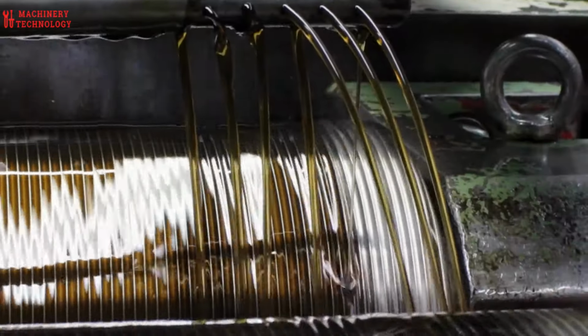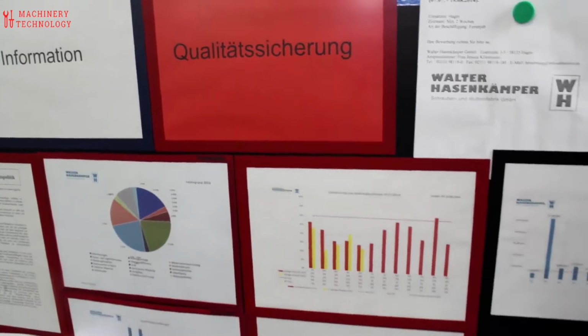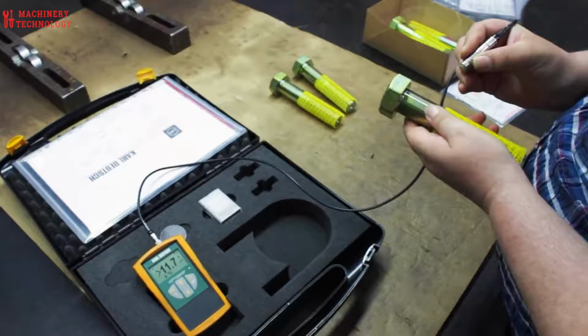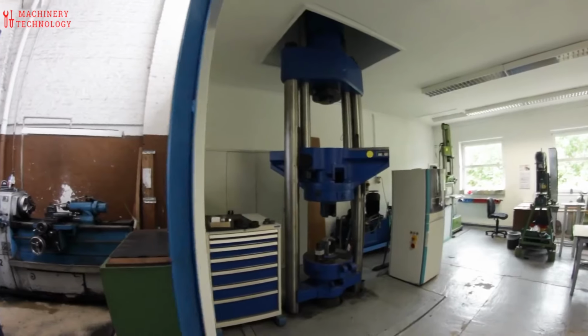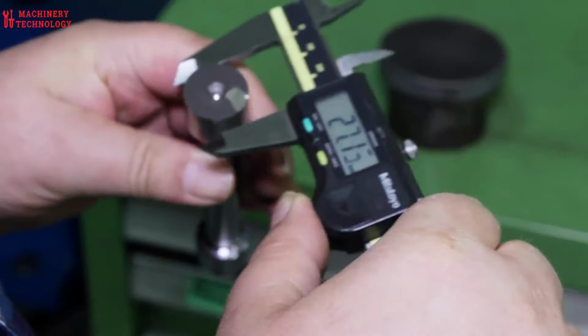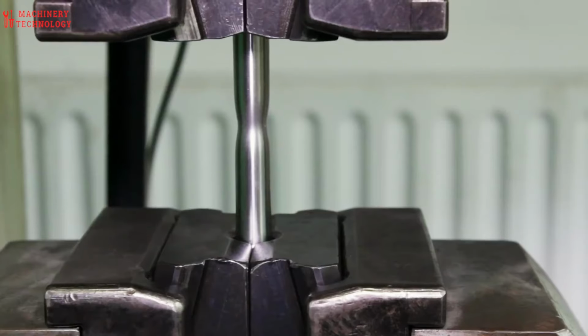Once shaped, the bolts enter a thermal gauntlet. Here, they undergo heat treatment to achieve their ultimate strength and hardness. This process might involve quenching, a rapid cooling technique, followed by tempering, a controlled reheating stage. Finally, after cooling, these titans of the bolt world undergo rigorous inspections, cleaning, and sometimes even a protective coating to shield them from the harsh realities of corrosion.